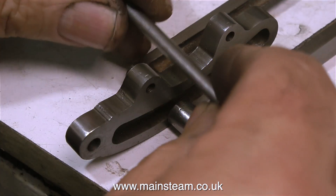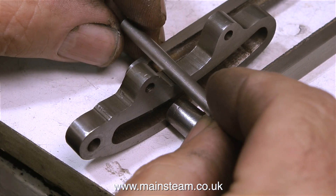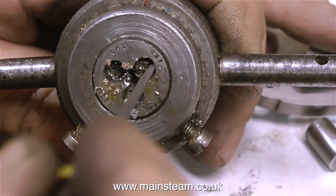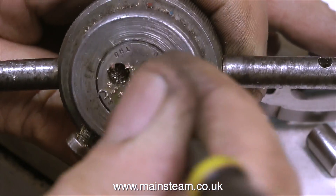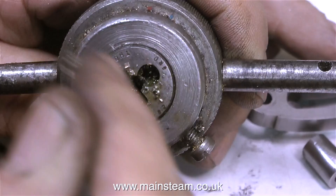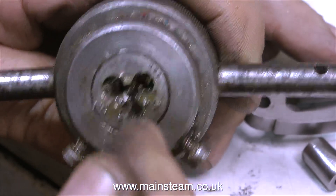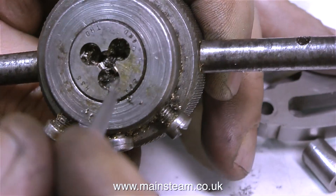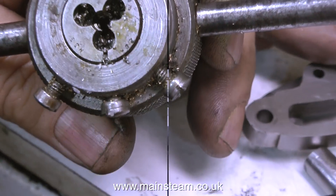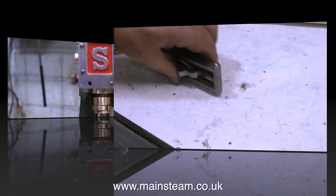It's back to the drawing board. I get another piece of stainless steel and start again. But before I do, I think it's a good idea to clean out the die. You can see all the swarf from the cutting operations — this die has cut two threads, one which was perfect and one which was not so perfect. When threading stainless steel it is vital to clean out the die very frequently, and after following this simple rule, every one of the threads made on these two pins is perfect.